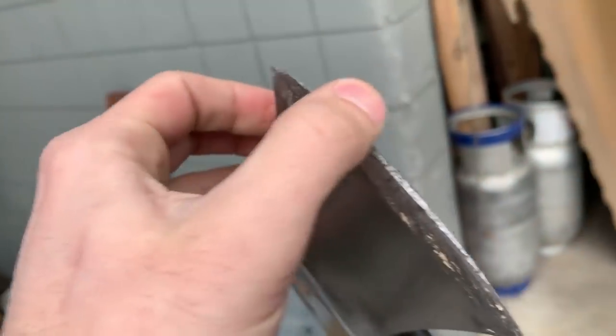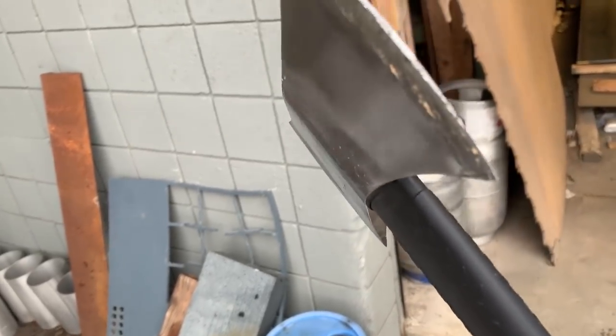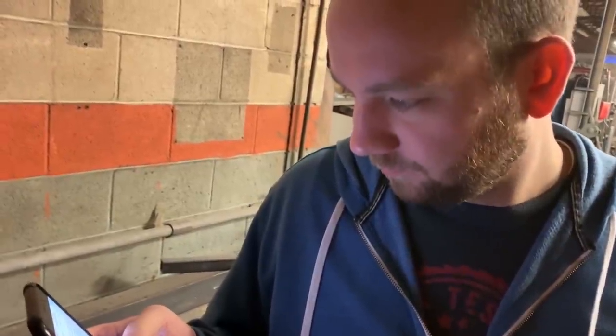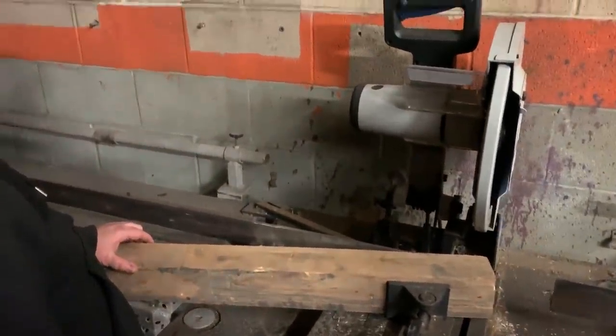Let's take a look at that now. Oh, that's like... How's a rock harder than an anvil? That's actually doing a really good job though — we've got a decently dull axe. Now we need to sharpen it. What angle are axes sharpened? It says most axes have a 30 to 40 degree angle at the end of the bit. What is an axe bit? Is that called a bit? Like a drill bit, but axe. So axe bit: 30 to 40 degree angle, which means we need 15 to 20 degrees on each side.